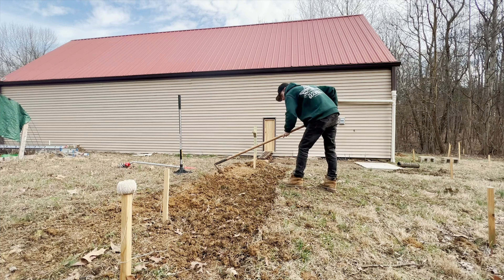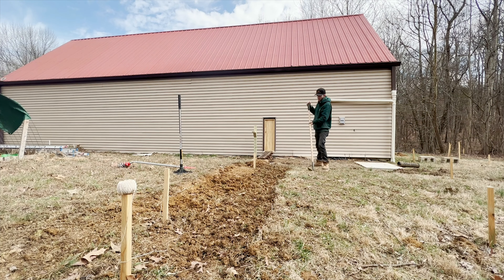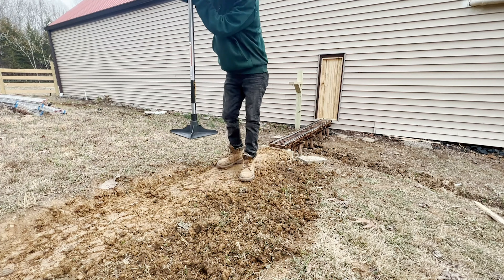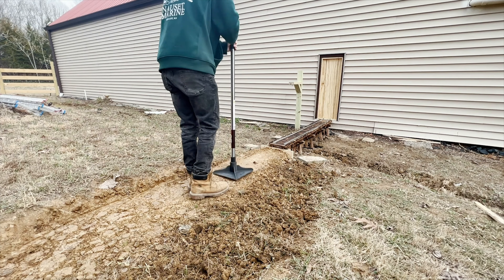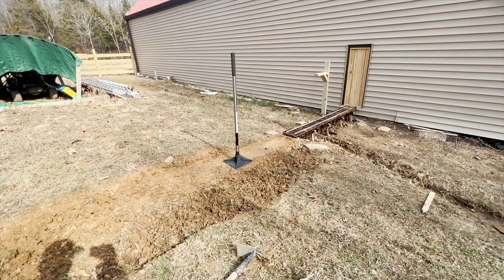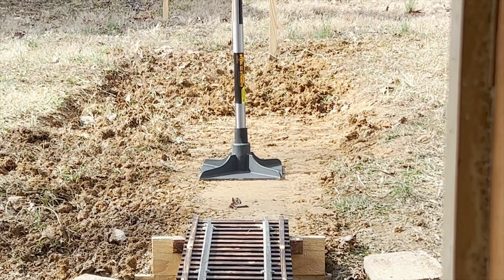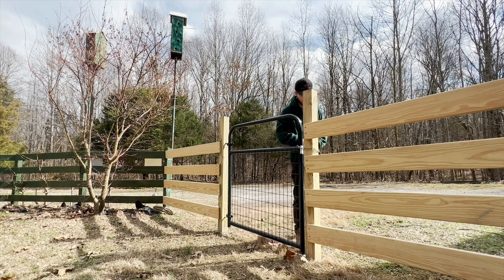This process really just begins with a whole lot of digging in the dirt. It's super important to have the ground below the track solid and level, so I started out by digging a path significantly wider than the rail bed. The ties are going to be roughly nine inches long, so the rail bed's going to be just over a foot wide, so I'm digging roughly a three-foot wide stretch. The dirt I'm working with is actually really tough clay, so you'll see me using a variety of tools to chip away at the hillside, break up the chunks, and work the ground into more manageable grades around the right-of-way.